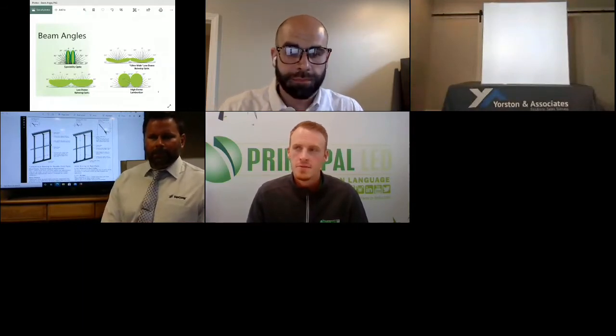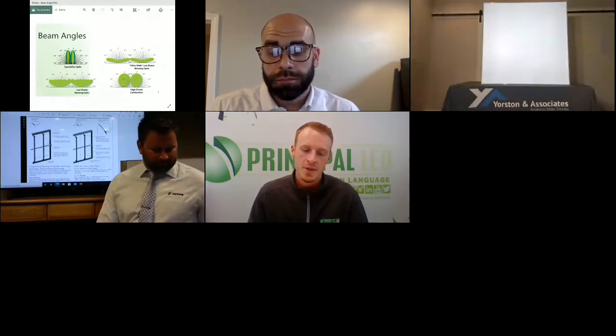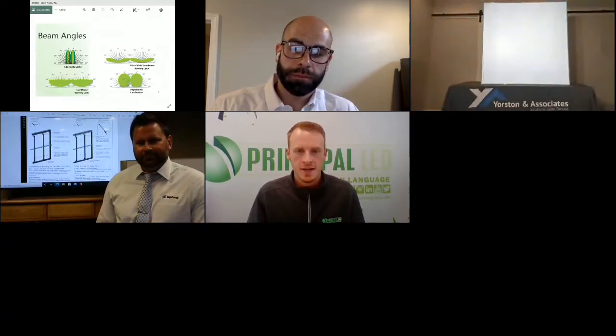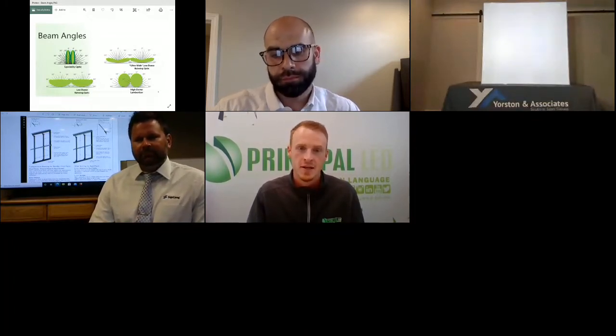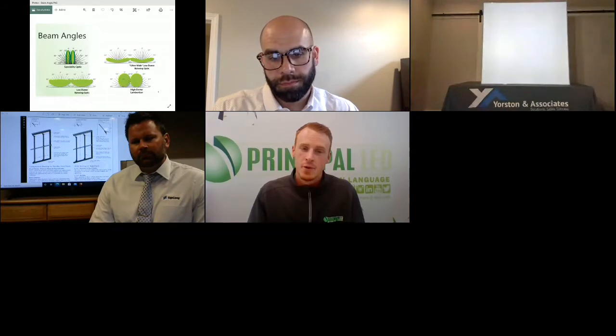Yes. And I've had this happen a couple of times and it's really tough, but we can make it work. We've had people send in layout requests and they've got a sign that's 4 foot by 8 foot and it's 8 inches deep and it's got a 6 inch pole. So literally the face is 2 inches away, or actually 1 inch on each side away from the face. It's kind of hard to not get a shadow from that, but we'll populate it the best we can to eliminate as much of that shadow as possible. But that's where we have the conversation up front and say, hey, that pole is pretty big for the internal guts of that sign. You may see a shadow on that. And that's just one of the things that's hard to find a diehard solution for.